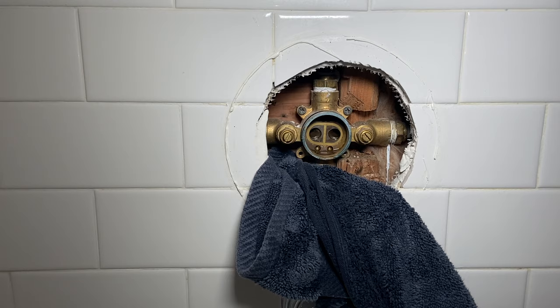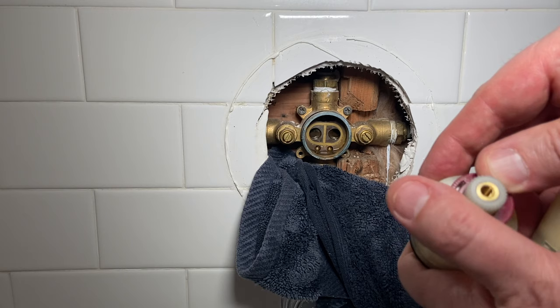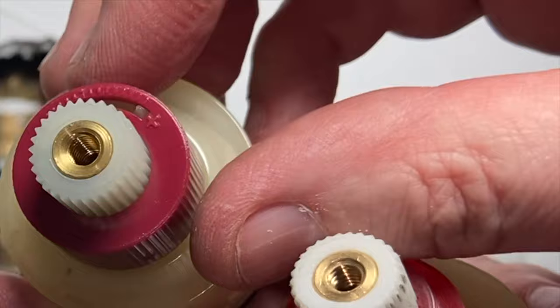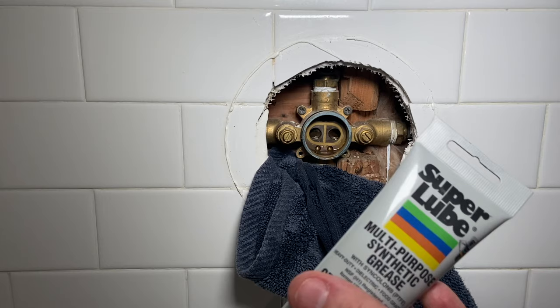Thank you Danco, because it's the only one I could find. Pretty much similar except for this ring right here — it's a different design of anti-scald. This little red knob you can turn to make the water hotter or not. There are no small children here, but if you did want to turn it down you always could — that limits how far the valve opens and closes. I want to put a little something around this O-ring and around this gasket. I recently bought another tube of Super Lube.